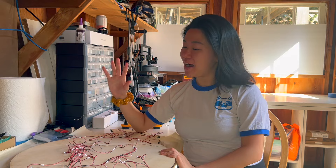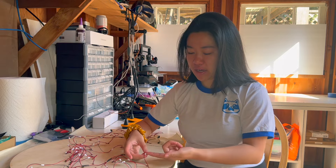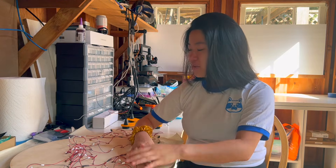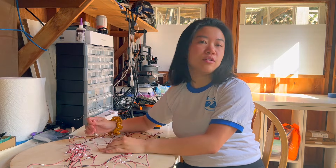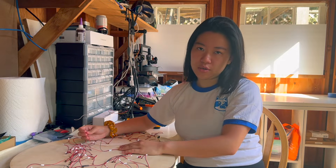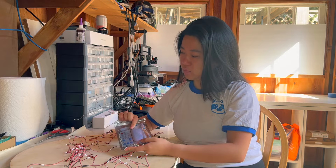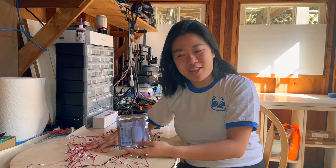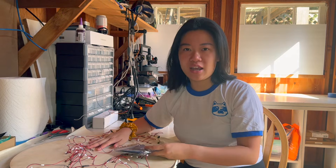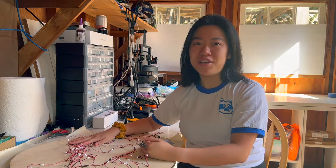We are almost there — as you can see from the absolute pleasure of wires here, I have now successfully glued all of those LED strips in place and pulled their connectors through these holes into the back and connected them up in the right order. Next I'm going to take the power and ground wires from each of those parallel sections and connect them all together, then connect them to the power and ground of the power adapter. After that I'll also add an RF wireless dimmer-brighter, do a little final wiring tidying, add the mounting hardware so this thing can get hung up on the wall, and then it should be finished.